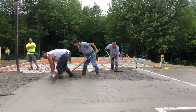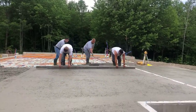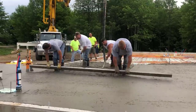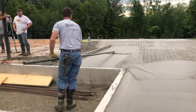We're using a 14-foot straight edge today and doing what we call kick screeding — we kick and fill in our footprints as we're screeding backwards. It's a pretty fast way to screed, kind of old school, but it's the way we were taught: two guys on the screed, one or two guys raking. We can screed quite a bit of concrete pretty fast.